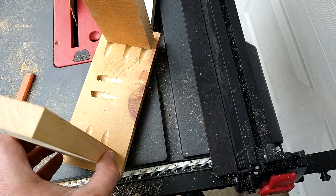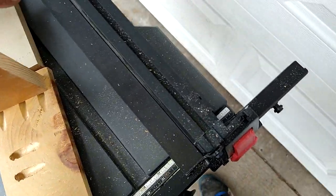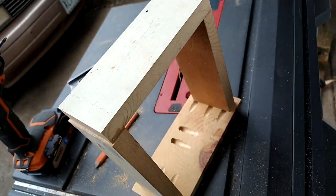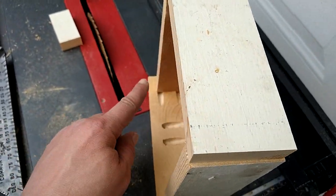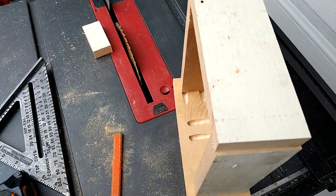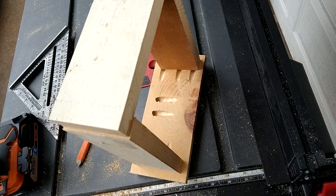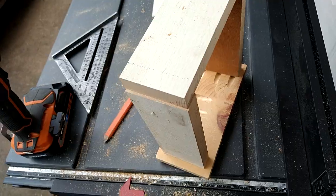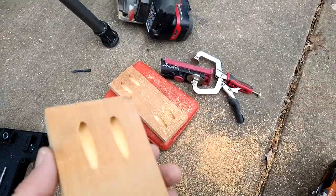As you can see, this is basically what I'm gonna build — like that, like that, like that — so there's gonna be like the basis of the drawer. And then usually you're going to do a straight cut with a straight bit in there, depending on what size of material you're using. That's pretty much what I'm gonna do — I'm gonna pocket jig these together.